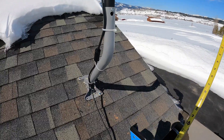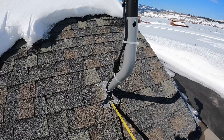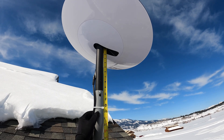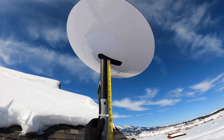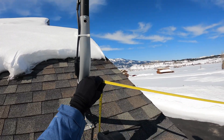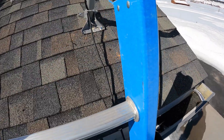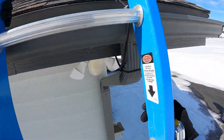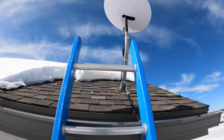I'm happy with that — I think it looks good. Make sure you mount it in some good structure. The Starlink mast is about 12 or 13 inches, so if you install this on your roof, you're not going to be able to deal with much snow. Run the cable down around here, out of the gutter, and back underneath the eave into the attic.